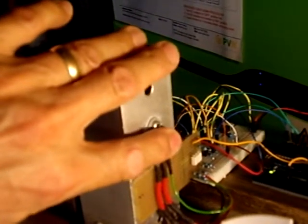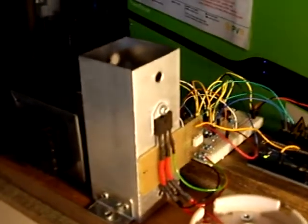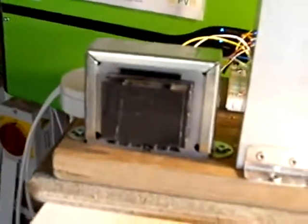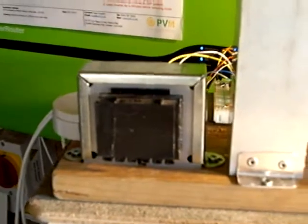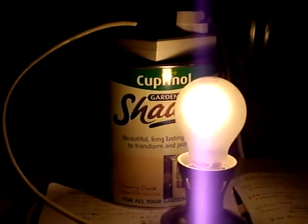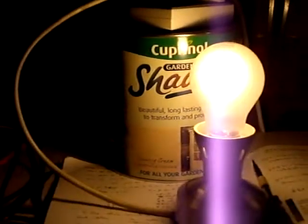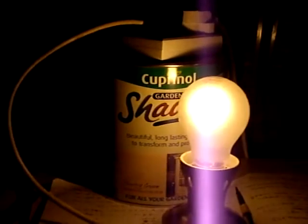The sun's gone behind some clouds, it's not as hot as it was earlier. It's heated up a full tank of water already today and it's about midday. The only other component is the mains transformer - rather than using the standard telecom one with AC output I had before, I've wired it up with this beast to see if it makes any difference. The reason the light is on is because the thermostat has already tripped out, so any surplus power is simply going off to the mains. I need to put something on that circuit to see what's going on, so I've just patched that in.